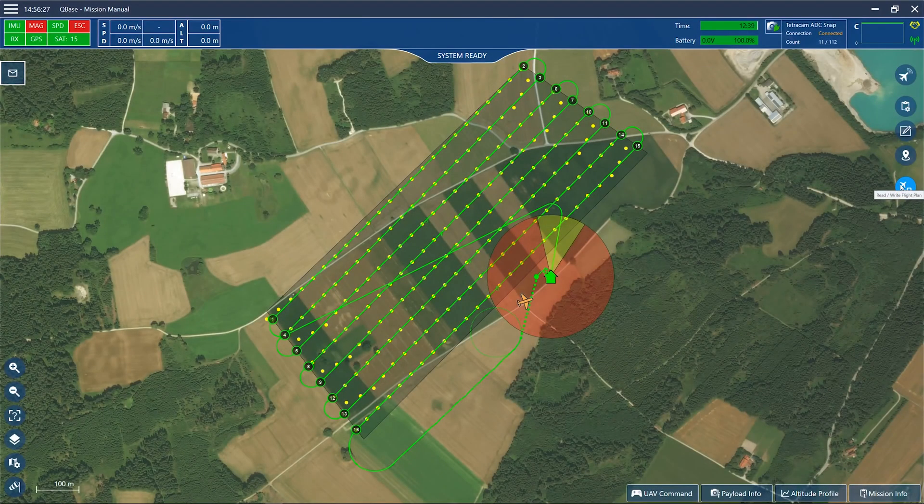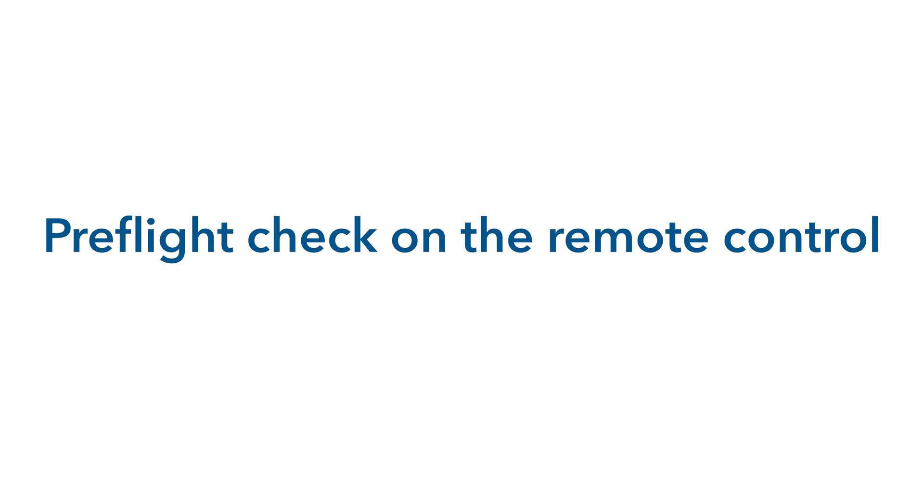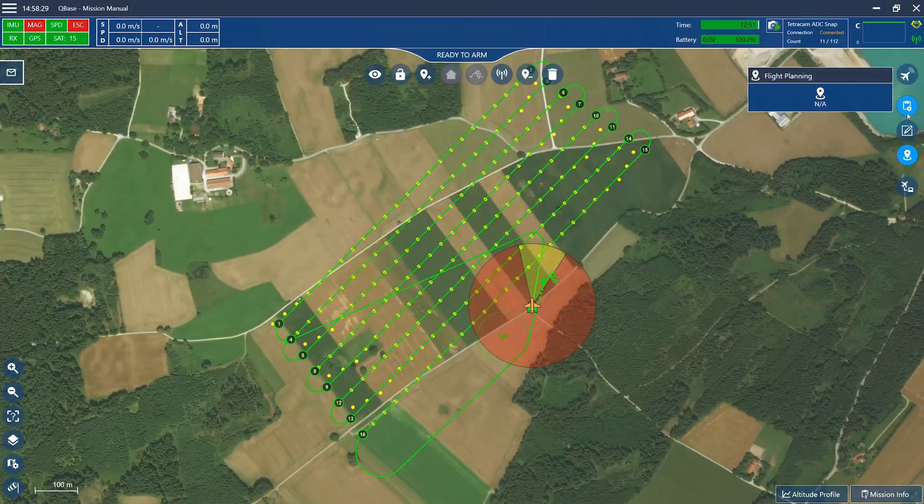In order to check the flight plan, upload the flight plan to the Trinity and select the right flight plan. The window is closed automatically after 5 seconds. Initiate the pre-flight check by tapping the button on the remote control. The plane will self-check and initialize the attitude and position algorithms during the pre-flight check. The home waypoint is automatically adjusted to the real take-off position.